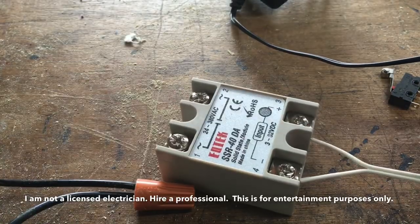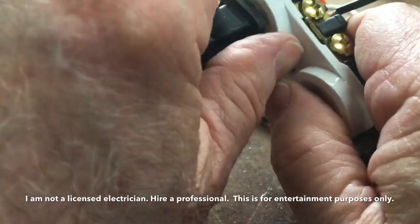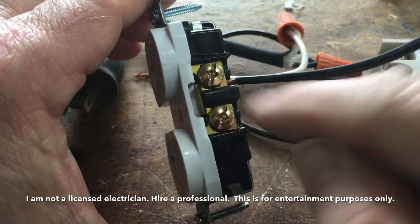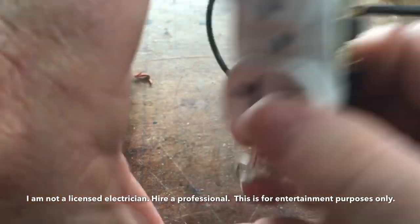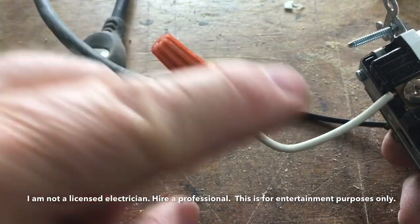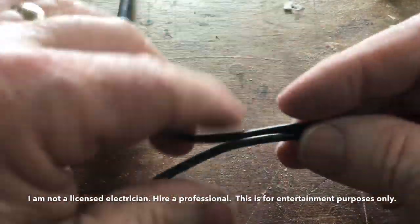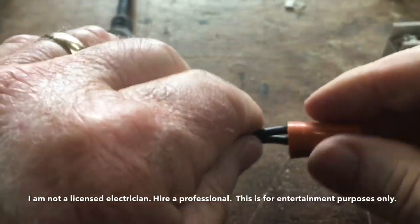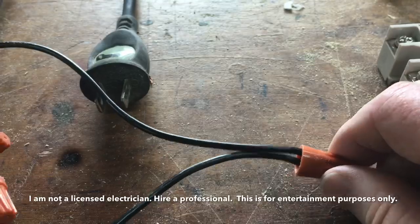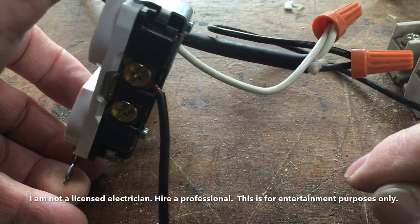Now for my little experiment, I wanted to show you this to begin with. On the plug, this is my power supply and nothing is connected right now. On the gold side, that's where my hot lead — the black lead — comes in. On the other side is the common, and that's the white. So I just went ahead and wired those two together. Before I plug it in, I am going to protect and cover up these screws so there's no risk of getting shocked.